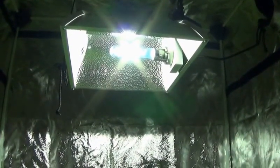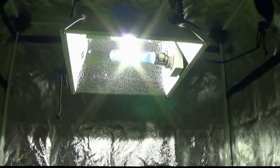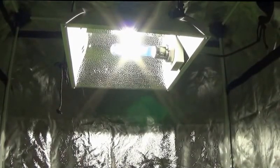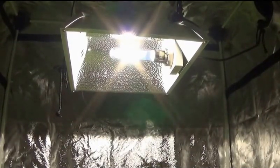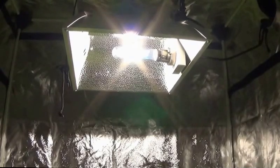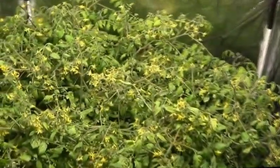The warm-up time of this bulb is about five minutes. As you can see, it is getting brighter and brighter as we speak. Metal halides in general are not effective for hot starts. You must wait anywhere between 10 to 20 minutes between the time you turn it off and turn it back on again. But here we are — full spectrum again.